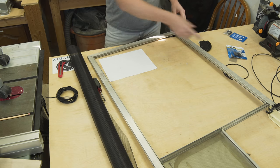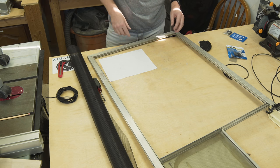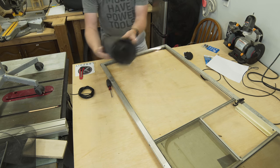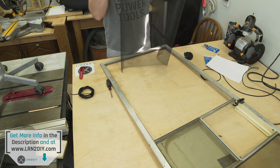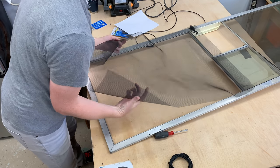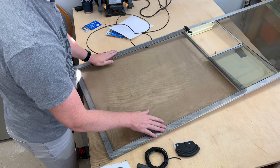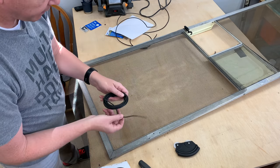Now once you've got your screen out, that's a great time to clean up your grooves. I've got a lot of debris in here, so I'm going to clean that up real quick and then get ready to put the new screen in. Next up, we're going to take some of our screen material — this is just extra that I had from a previous job — and you want to lay it out so it covers everything, then get out some scissors. Fiberglass, aluminum, and pet screen can all be cut with scissors. Once you've got it laid out, if you're able to reuse your spline go ahead and do so. I'm just going to put in a new spline because I have some.